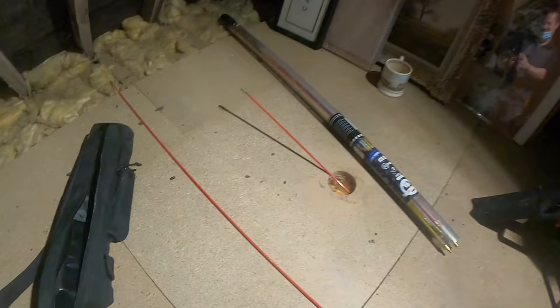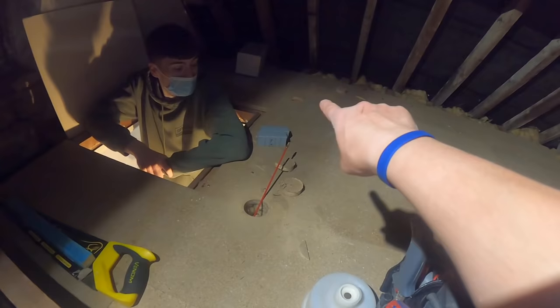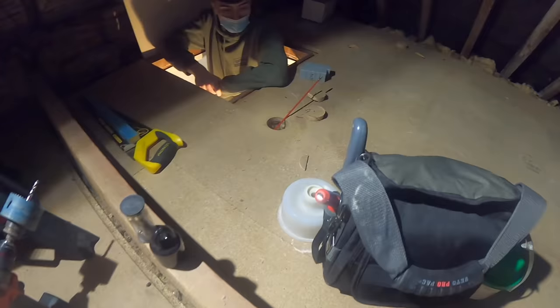Right, this is our downlight in the hallway, look, above stairs. Managed to fish along to there, which is where the existing thing is. That's James poking his head up the loft hatch, and then that one over there is the other downlight. So these are all in the same run, okay? So I'm hoping we can fish to there and then hopefully fish to that one. Keep all the wiring under the floor in this one, and we'll just put a Wago box under that floor, put it back, because it's so near the hatch, we don't want to leave a hole there so they can fall down. And we'll hopefully do the same at that other end.